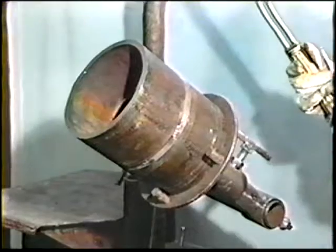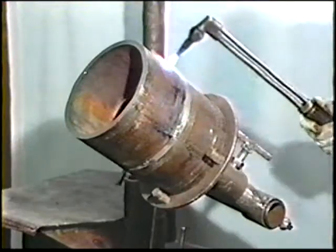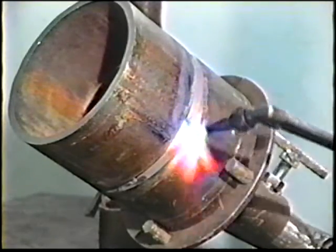In addition, if the joint is damp, apply heat with a torch to completely dry the area of the weld. Do not weld on surfaces covered with oil, water, dirt, paint, and so forth.